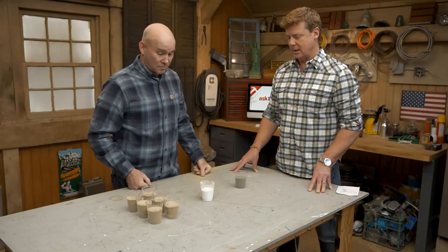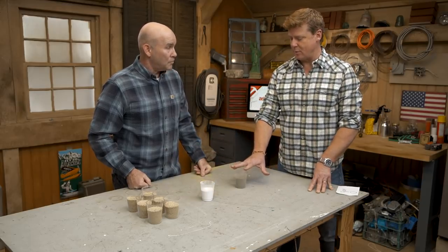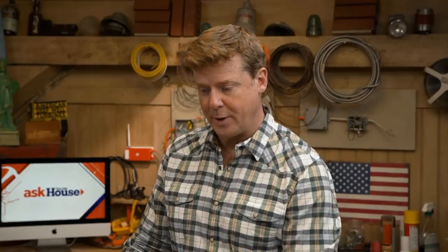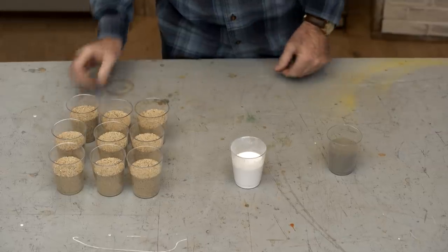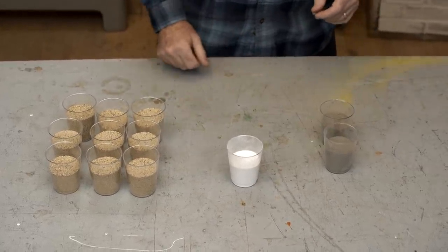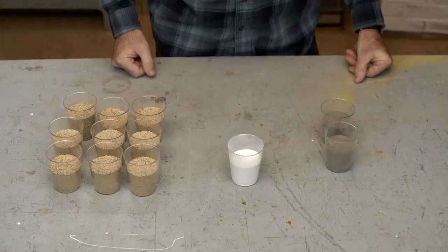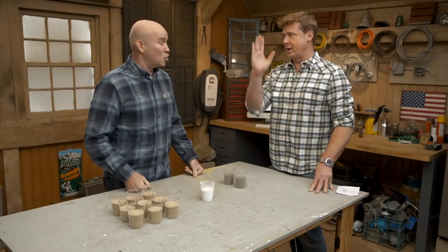From O to N, the next formula is S. For Type S you add back sand to nine parts, add another Portland — two Portlands total — but you don't increase the lime, which is the flexibility. More strength, more sand. Where do you use Type S? Think of an elevator shaft — so rigid. It can be interior or exterior, but it's going to be something that wants to stay together: tall, no movement, like an elevator going up and down.